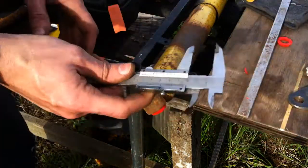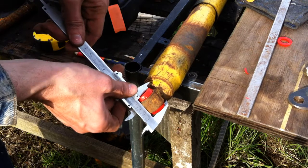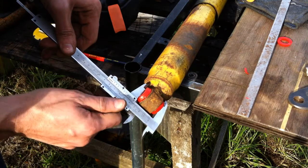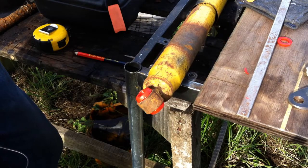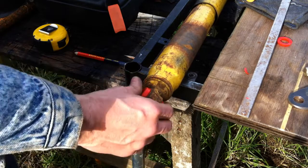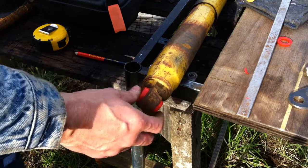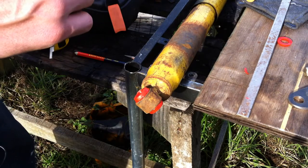Now I need to take an overall measurement of the bushings and the housing together, and you want to make sure you use the flat spot on the caliper. You can do it with a measuring tape as well, but it's a little bit more exact with a caliper — make sure it's nice and flat. Here I see that my overall length is 1 and 15 sixteenths. So I'll do 1 and 7 eighths for the bung — that way it'll fit in there real nice, it'll tighten around it and it'll be good. You don't want play inside the two tabs. You could actually do it probably even two inches apart and it would fit pretty well.